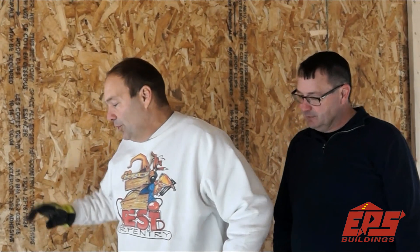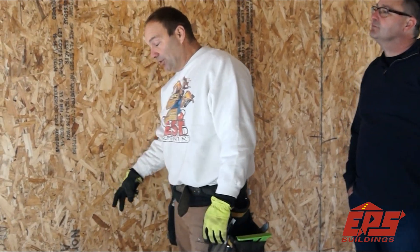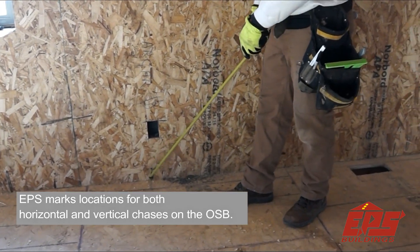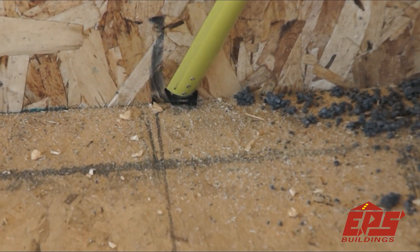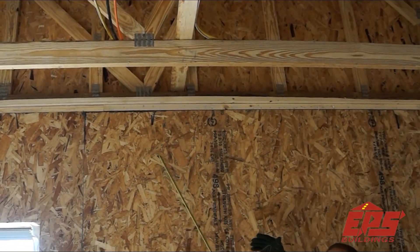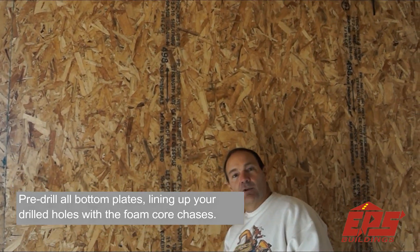I just want to take a few minutes and thank you for your time here today Tim, and just kind of go back through some of the more helpful tips that we've reiterated. Tell us a little bit about the importance of pre-planning when it comes to electrical. When you're laying out your panels here and your panels are laying horizontal on some sawhorses, and you've got your bottom plate already lag bolted down, you're going to want to measure over from your previous panel. So we would measure from here and we know where our next electrical chase is. This mark here on the floor indicates that I have drilled through that plate through the floor into the basement, so in case that electrician wants to use that hole it's there and available. Definitely take the time to drill your holes down. The ones up top on a gable end obviously it's not a problem to get the drill in there. And even on the rake end because we use our energy heel trusses there's plenty of room to get your drill up there and drill down. So definitely pre-drill the ones at the floor — it'll make everything go a lot smoother.